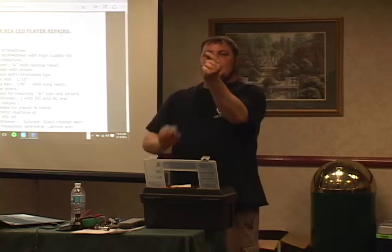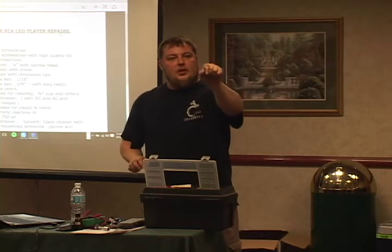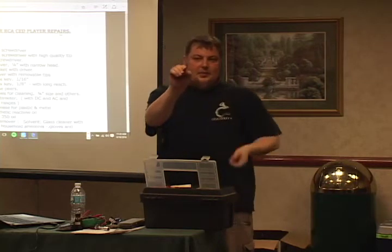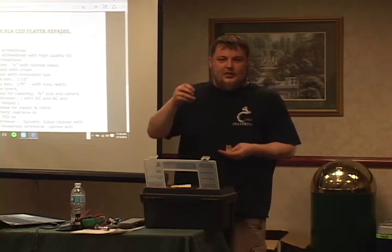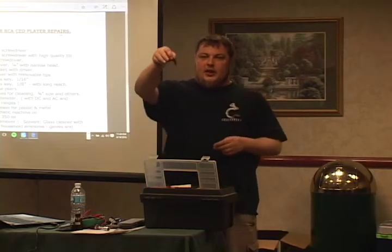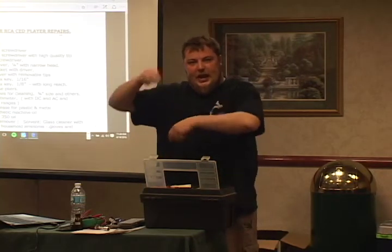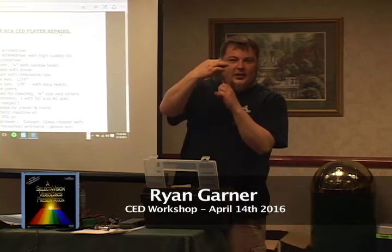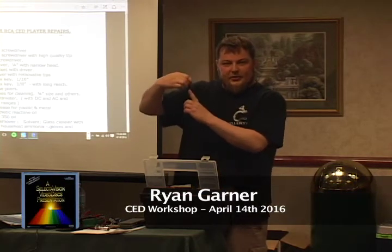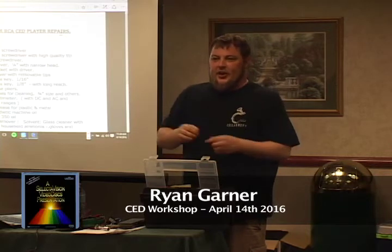It's really weird. It's kind of hard to see from there, obviously, but this part's real thin, this part is a little thicker. Depending on the turntable you have, whether it's the F or G or the 250, 200 versus 100, you have to use a certain side of that gauge. And then you can check where the little metal tabs are. You just push them right there, and as long as it goes right by and clears, you're good to go.